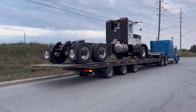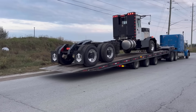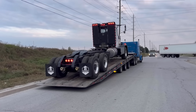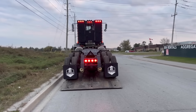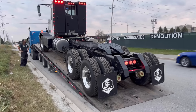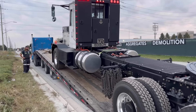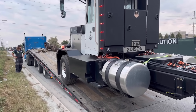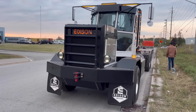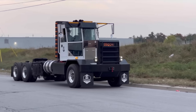The next step: you pull the step deck back away. The cool thing about these landoll trailers is those rear axle groups go forward with a hydraulic cylinder — when they go forward, the deck tilts up, and then you just reverse your truck off. So if you've got a trailer without low-bed ramps, you hire a tow truck company with a landoll, back the step deck up to the landoll, transfer the load, then back the vehicle off like a loading ramp. Big thanks to Pepper, the tow truck driver — real awesome guy. Now I'm just going to take her from the parking lot and put her inside the Flowdraulic shop.